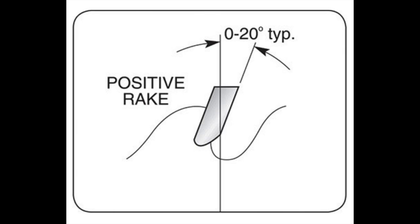You don't want to use a high positive rake blade on a chop saw. A blade with high positive rake on a chop saw can be dangerous because as that blade cuts through the wood, it's going in an uphill travel and it can grab the piece of wood and pull it right off the base of the chop saw.